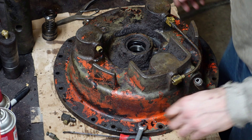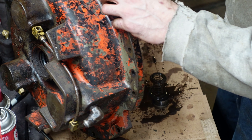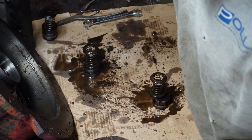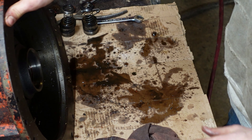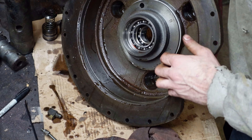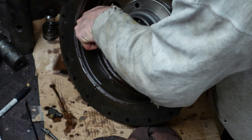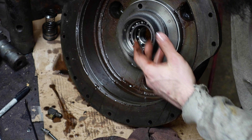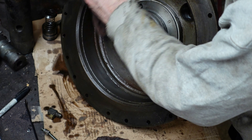Looks like it works pretty well — I'm glad I had it facing down; those sound like they hit pretty hard. There they are. So, three brake pistons, brake springs, brake seals. And there is the housing with our three bores — they don't look scored up or anything, I think these are good. This one's got some sort of mud junk in it, but I'm pretty sure that's just old cruddy fluid. That's taking this apart — I'll get some new parts and we'll put it all back together.